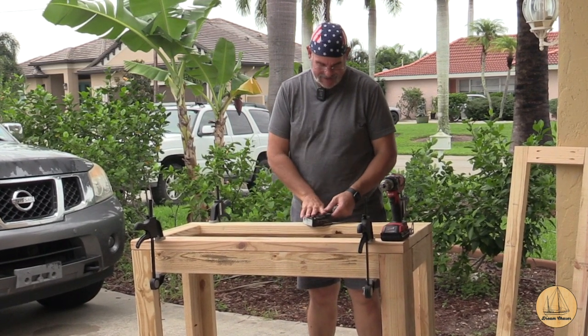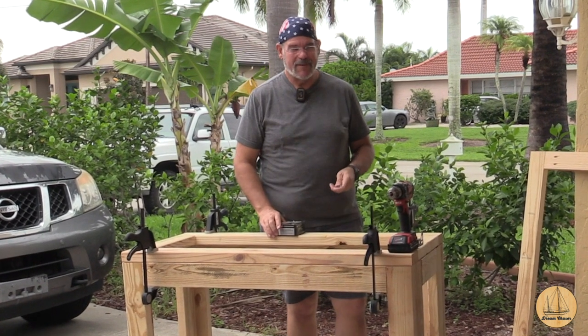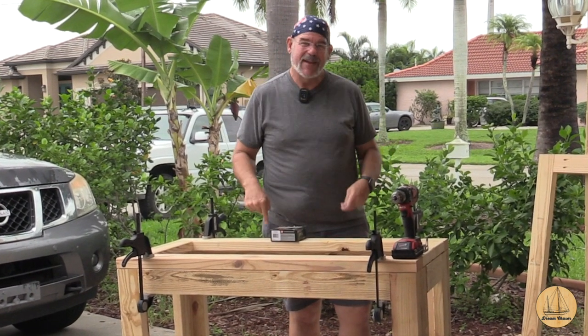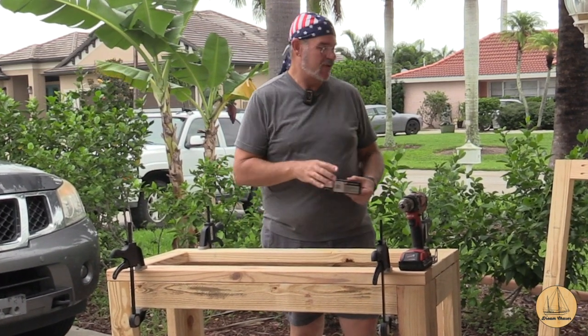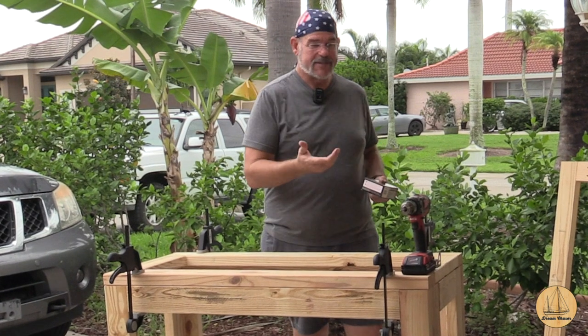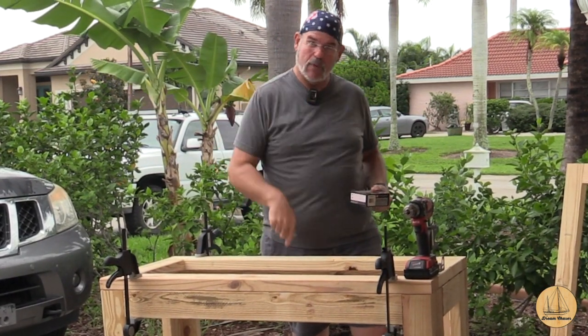The nice thing is I buy these good exterior ones. If you use a good high-powered cordless drill, you can run them right in with enough power to just countersink them down below. Most of those electric cordless drills have a clutch on them. I have mine set to 8, and that should be enough to just drive it below the surface but not pull it way in there.